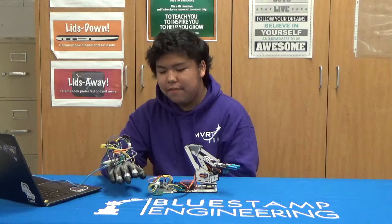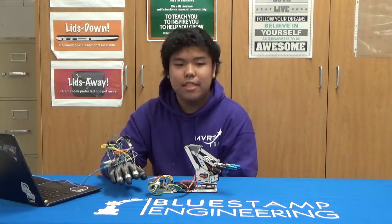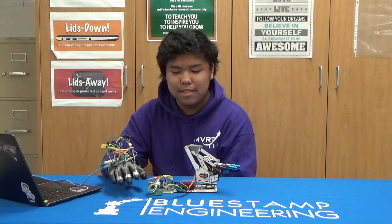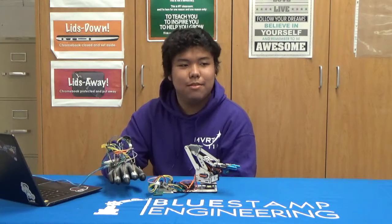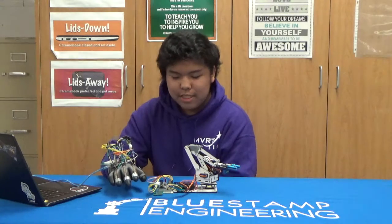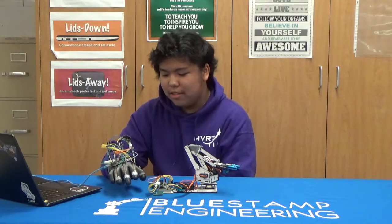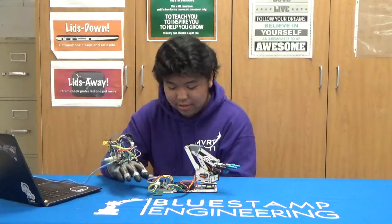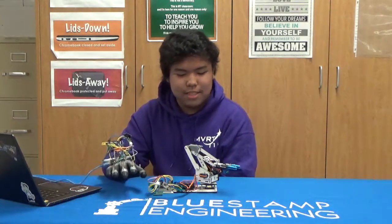So a major problem I faced in this milestone was having the NRFs interact with each other. In the beginning, to make sure the NRFs were working, I wanted to send simple messages. However, even though the transmitter code displayed that it was sending messages, the receiver code did not receive anything from the transmitter NRF. But after research and rewiring all of the SPI pins to the ICSP pins on the Arduino instead of the digital pins, I was successful in sending simple messages.